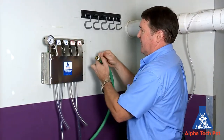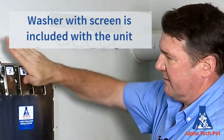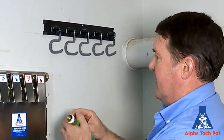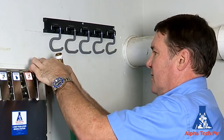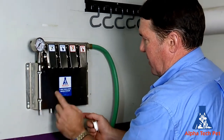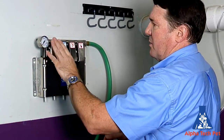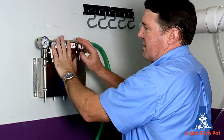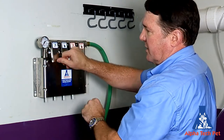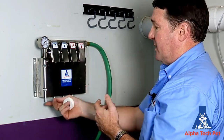Now we're going to attach the hose, and you want to make sure you use a washer that has a screen in it — that'll eliminate any chance of debris getting sucked in and clogging the injectors and ruining your mixture. So we'll put that in there first, then put the hoses on here: the spray bottle hose and the mop bucket hose. When you check water pressure, you don't want static water pressure where no water's flowing — push one of the levers, let the water flow, then take a reading. That's how we'll determine what type of pin we need.